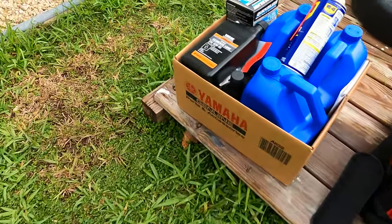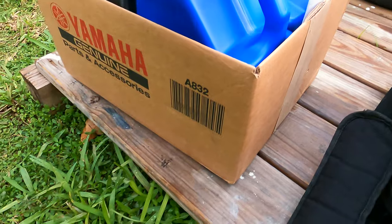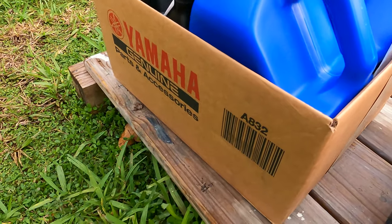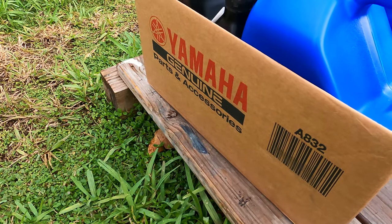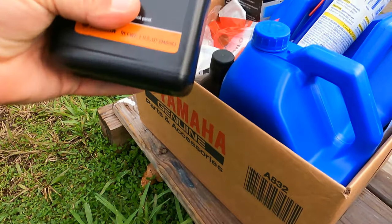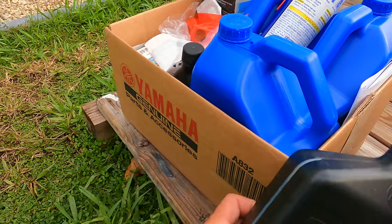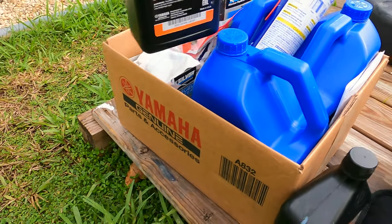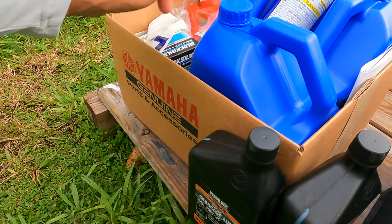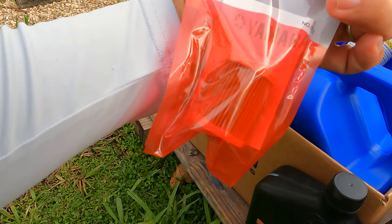So I have here some parts. I bought it here at Key West in Yamaha. So we got oil. He recommends me 20W40, which is better for hot weather, which is here. Here is a gear case lube. That's for a lower unit. For one engine. This one is for second engine. I have everything like twice. This is a fuel filter,